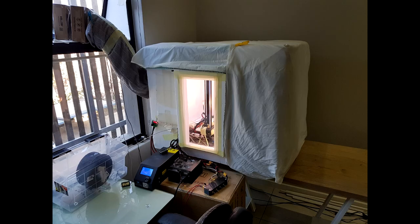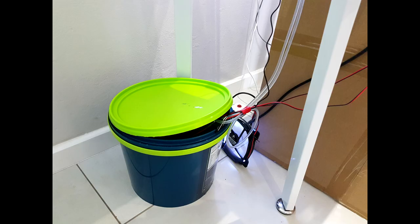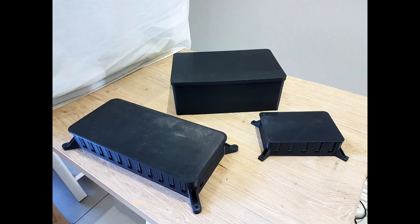Here's a lesson in how to do it properly, courtesy of a gentleman named Adrian. He's built a fully insulated enclosure around the 3D printer with thick foam blocks on the inside to stop heat escaping. The stepper motors are cooled via water and all of the air inside the chamber is filtered and ducted out of the room. The results are enormous warp-free ABS parts — so impressive. I'll be trying to adopt some of these principles as I refine my setup.